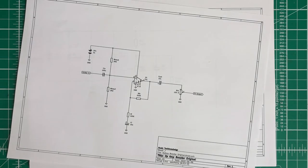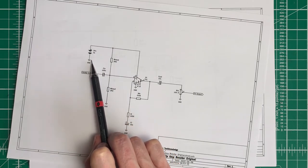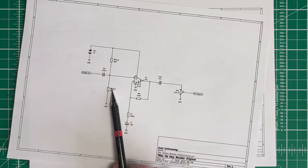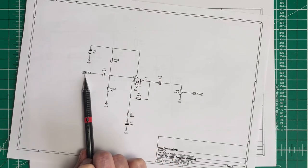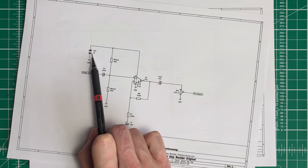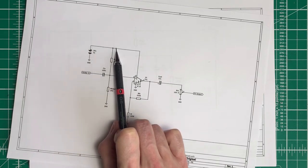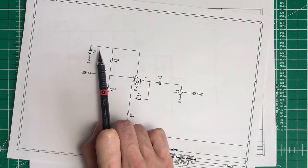Let's look at the power section. In our previous circuit, we have a 9-volt battery connected between the positive rail and ground, with the voltage divided in half using two 2.2 mega-ohm resistors — R-bias 1 and R-bias 2 — providing a 4.5-volt bias voltage superimposed with our guitar signal into the non-inverting input. We can do better than this: we can filter the power supply so that any dropouts, variations, or unwanted noise don't affect our op-amp. We can also protect the circuit against reverse polarity.